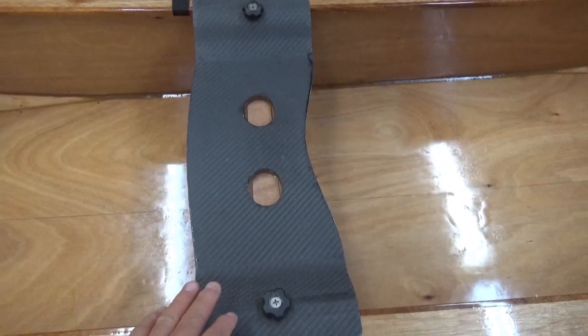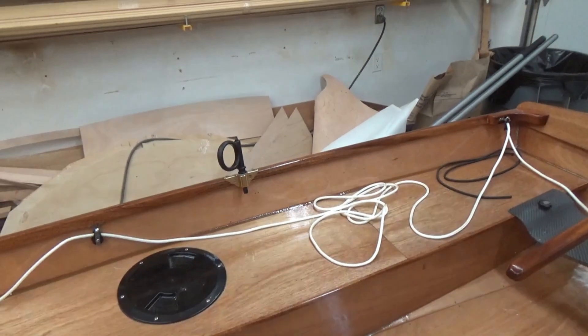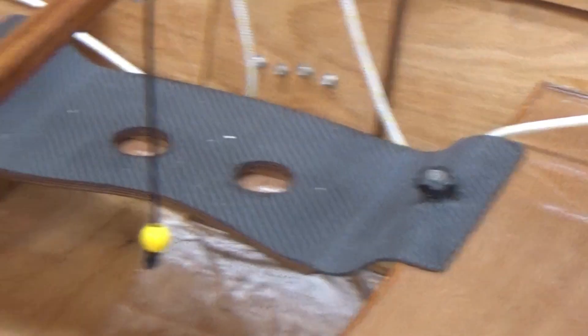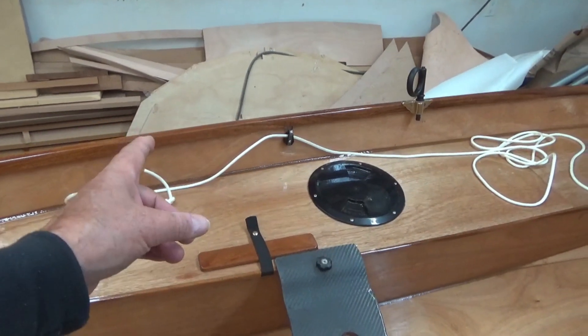We have the new seats in — they are pre-made by the kit supplier in carbon fiber. There are two bolts with knobs to tighten down so you can position the seats. We've got one set of oarlocks in, because if there are two people in the boat — someone in the rear seat and someone in the center seat — the center seat may need to slide forward for balance, so there'll likely be a second set of oarlocks attached further up. Now that I have the foils — the rudder and the centerboard — all done and installed, it's time to move on to the rigging for all the sail components. That'll be the next video, and then we're getting ready for launch day. Thank you very much for watching — if you like this video please give me a thumbs up and maybe consider becoming a subscriber. See you next video.